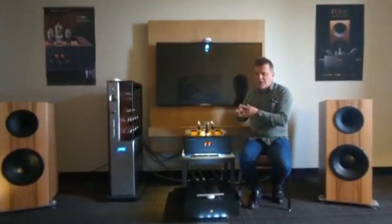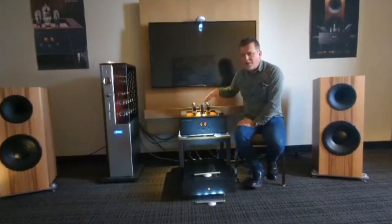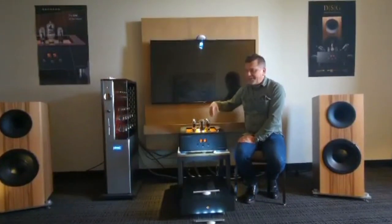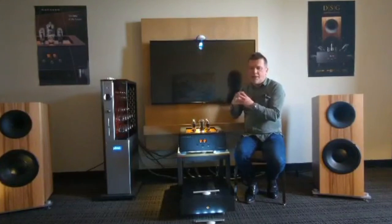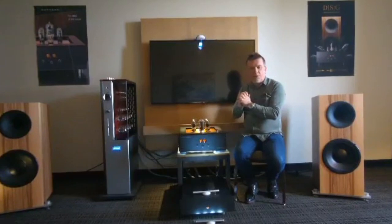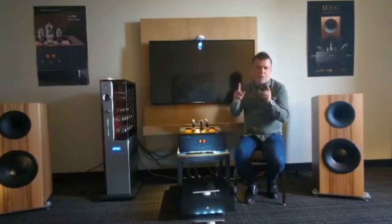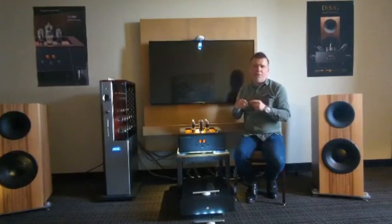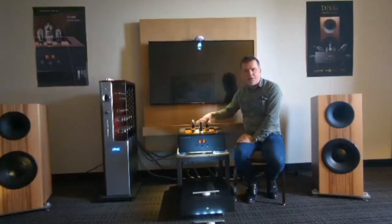So 2 of the grids are connected to the triode in such a way that the triode is a differential amplifier between the grids. And you cannot consider or even measure these 2 tubes separately, because they become unity. They become like a hybrid of 2 different solutions, and they work in unison. So if the tube with 2 electrodes is a diode, and then you have a triode, and then you have a pentode, so this is an octode. It's like a 1 tube with 8 electrodes.